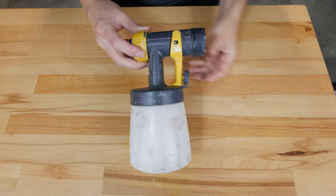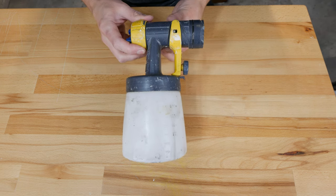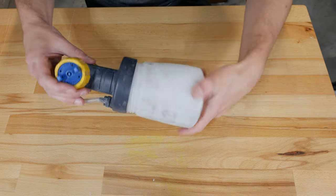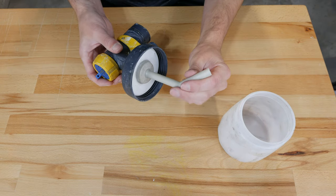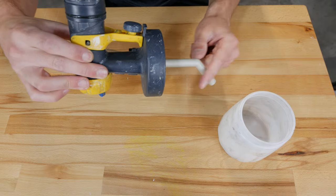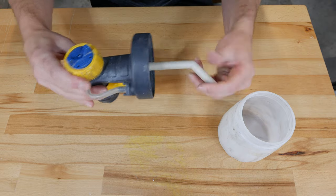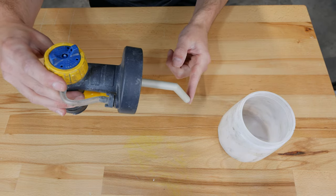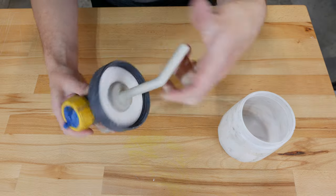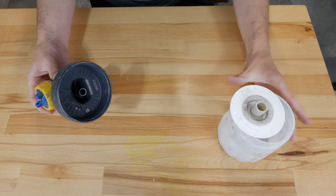This is the detail finish nozzle. The paint container at the bottom is removable and comes off. You have a suction tube that spins — when you're painting downward, gravity puts the paint at the bottom of the container, so the tube spins down to reach it. If you're painting upward, you want the tube rotated back so gravity takes the paint down and you can suck it up. Make sure when you put the container back in that you press around it so it's airtight.